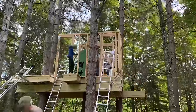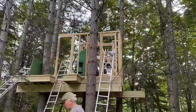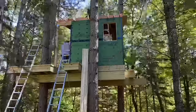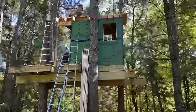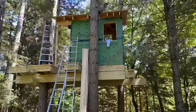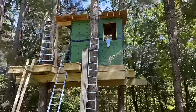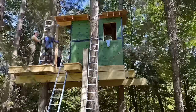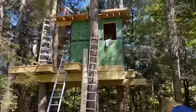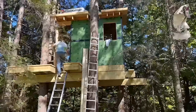The rafters were exposed Douglas fir, and the finished ceiling was cedar shiplap siding on top of the rafters. We used 2x4s on top of the shiplap to create overhangs and added insulation in the spaces above the indoor area. We used more zip sheathing for the roof and used an air gap mat under cedar shingles. The rest of the exterior siding and trim was more cedar, most of it sourced as overstock or lower grades to keep costs down.